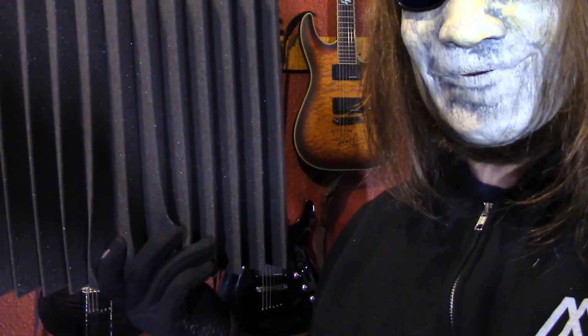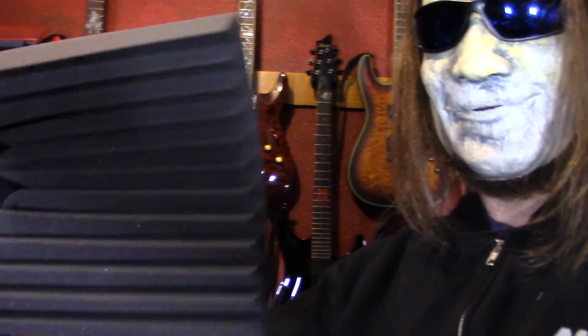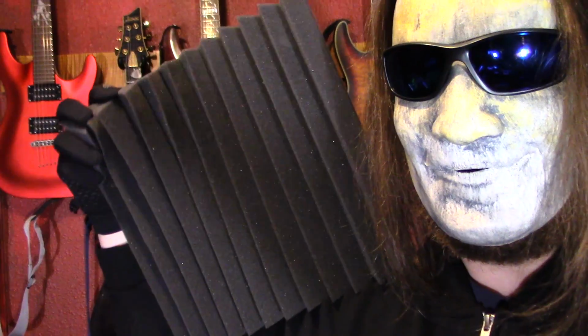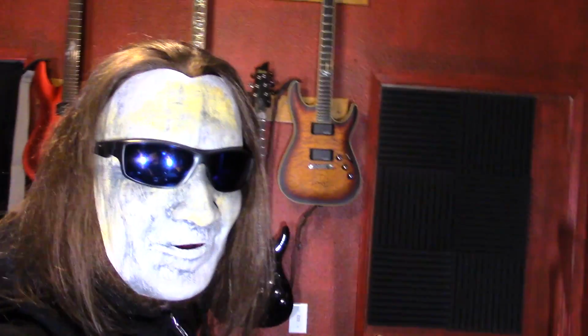But up here, right there, I'm going to have to put them all in a line, not alternating, because they're pinching up against the ceiling from that board. And these panels, since they're pinching, and that board isn't exactly square, I did that on purpose because I like that rough look to it. But these panels, if you tried to stand them up like this, they would bend, and they're a lot more rigid this way, up and down, than they are this way. You can see I can curl this a lot easier because these pleats or grooves will roll in on each other, unlike this way where it's a lot harder. See, it doesn't want to bend evenly like it does this way. So since they're being pinched up there, it's better to put it like this. It'll look more natural and I won't get those wobbly lines in them if I tried to stand them up. But then the rest of them on the wall, if there's nothing impeding them, will be like this, where they're alternated.